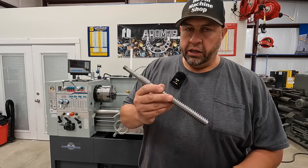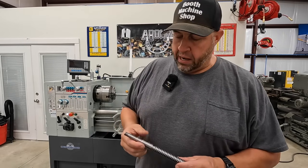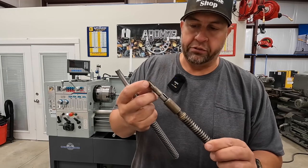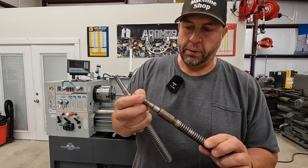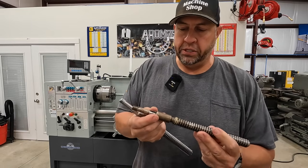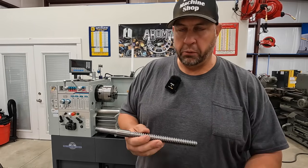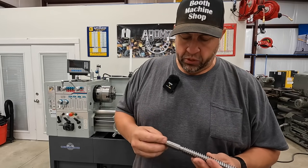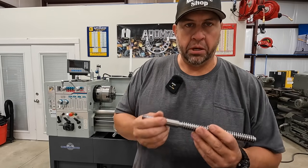So I think from here, we're gonna go back to the home shop. We've got a Woodruff key to mill in there, and then we have the straight key that's gonna be for your bearing nut retainer, the little lock ring. So that's the last two pieces of this guy that we've got to machine. We'll probably just go ahead and do that on the DoAll. I've got Woodruff cutters there, and we will just finish out the milling there.